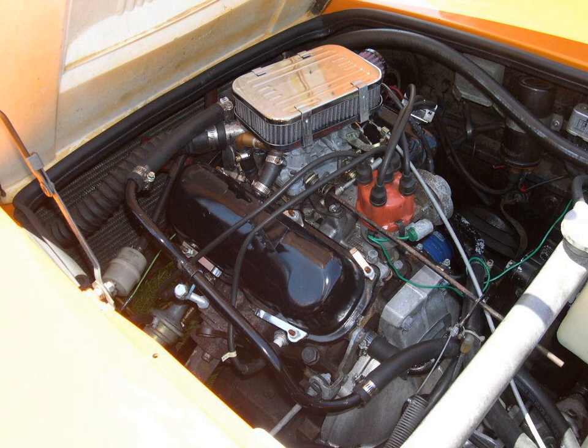Wisconsin Motor Manufacturing Company began producing air-cooled engines in 1929 and added a V4 design in 1935. The company discontinued its water-cooled versions by 1939 and manufactured only air-cooled V4 petrol engines in various displacements for industrial, agricultural, and stationary applications. Farm equipment manufacturers sourced Wisconsin V4s for their compact size and good power output. In 1968, the largest in the Wisconsin gasoline line was the new V465D, a 177 cu in (2.9 L) V4 rated at 65.9 horsepower (49 kW / 67 PS) at 3,000 rpm. Standard features included controlled pressurized lubrication and automatic protection against overheating.